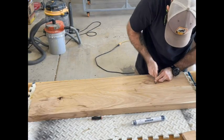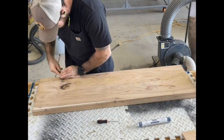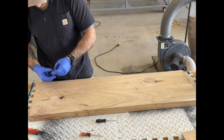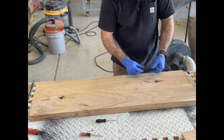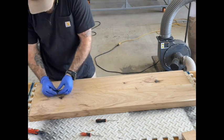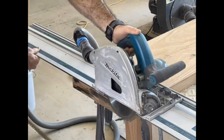Here you see me cleaning up some of that glue right where the bench top is going to rest, which allows the bench top to sit right on the seat I created for it. And right here — I know you're hoping there wasn't going to be any epoxy work, and no, there is not an epoxy pour. However, I'm using an epoxy putty. You can keep the knot holes open if you want, but I like to fill them all. I'm using this two-part epoxy putty in black — it comes in white, black, brown, and a couple other colors. I like to use black for smaller knots like this. It dries super hard, just about as hard as the wood, sands really nicely, and looks nice after finish.